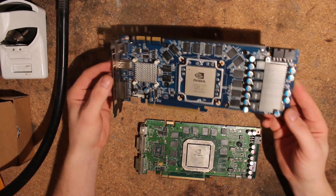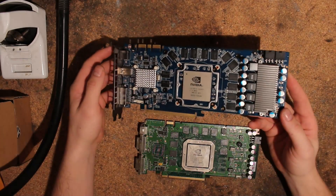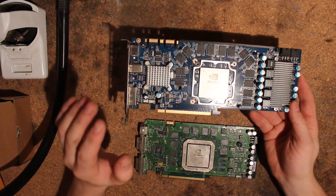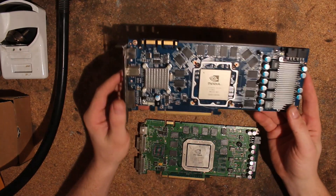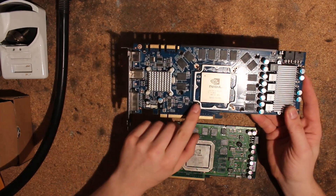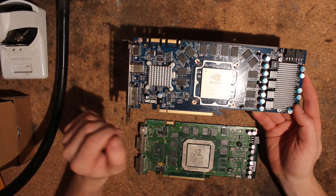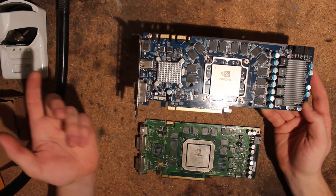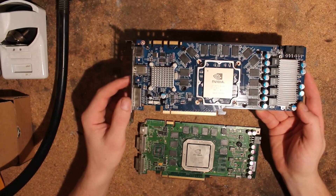This is a GTX 260, and if you cool this thing too much — just stock as it is — it's going to cold slow, meaning it's going to run at 2D clocks during 3D benchmarks. This happens because the card thinks it's overheating. There is a temperature sensor on here — it's called an ADT747 or something with 747 — and basically the measuring range overflows when it gets too cold, so it flips to the highest value and starts counting down again. Your card is probably going to think it's running at around 200 degrees or so — 255 would be the overflow value, so somewhere around 200-plus degrees on LN2.